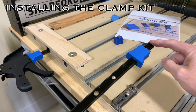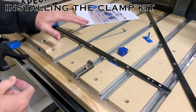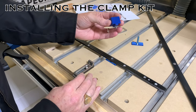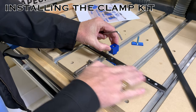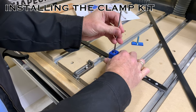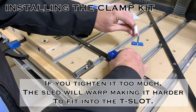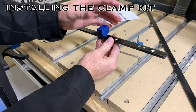Take the clamp stop and slip it onto the front end of the bar, sliding it all the way down against the bar clamp. Then take your sled, line it up with the bar clamp lengthwise, and fit it into the 8mm hole. Take your Allen wrench, fit it into the threaded insert, keeping things perpendicular to the length of the bar. Hold the block sled to maintain alignment and get it snug — don't crank it down too hard or you might warp the sled below.